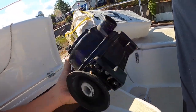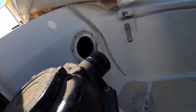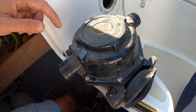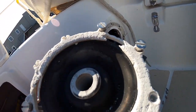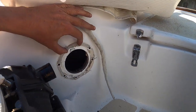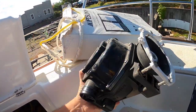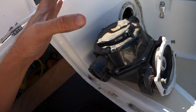There it is. This is the end with the pump — I'm going to put the machine screws back in here. There's the arrow that points to the discharge, so the little arrow indicates that this is the discharge end. I just put the gasket back on there — what's left of it. Those other four screws go in the top and bottom, and these two screws go here and here. There's something kind of rattling around in here — that doesn't sound too good.